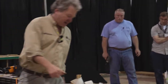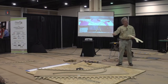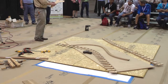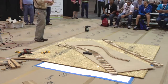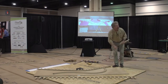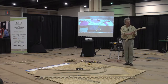I make these as an engineered floor. Well, we screwed it down, but you can see that there's a 5/16 piece of the solid wood on top, which is cut into strips, and then 1/2 inch birch plywood underneath. That way it doesn't spring back at all. We make an extra strip. So these strips are about 3/16 wide. I make an extra one for both sides. And then that allows this to be a little wide too. So you don't have to be fastidious about making it perfect size.